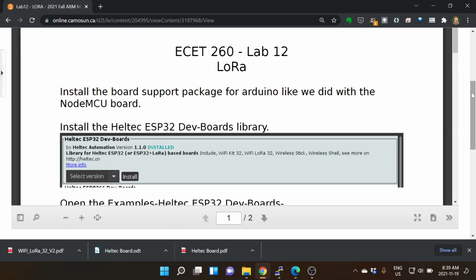They have a board that is referred to as kind of a Node MCU for ESP32. It's a little fatter and it doesn't give you as many breadboard pin options on the sides. The version of the ESP32 boards that I have got for you is the Heltec version, so there's an ESP32 inside, but in addition, they give you a little OLED screen on it. More specifically, the one that we're using also has a LoRa chip, and I'll talk about the LoRa chip. So it's got an ESP32, which comes with Wi-Fi and Bluetooth.